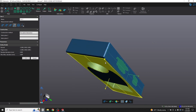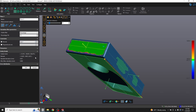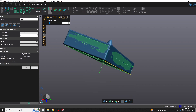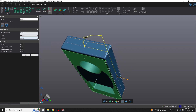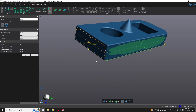Now I can create a plane based on that line. I'll click the plane tool again, and this time I'll select normal as my constraint and set this plane to be normal to the line I just created. Click on this face and then click OK. That creates plane three, which should be perpendicular to both planes I created before. We can check that using the angle tool — plane three against plane two: perfect right angle. And then against plane one: another perfect right angle. We already know that plane one and two are perpendicular, so I have what I need here. Click OK.